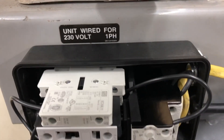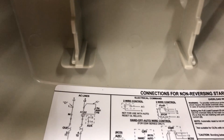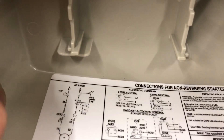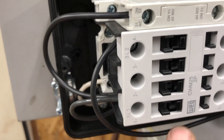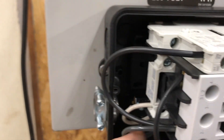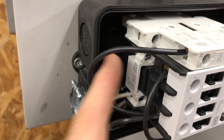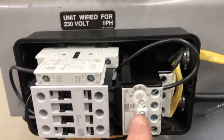According to their instructions, we are doing what's called a two-wire control. For a pressure switch, it says to connect wires to A1 and to terminal 1 — those connect to our external control, which is our pressure switch. So: A1 and 1. Now when this switch comes on, it completes the circuit, the relay closes, and it allows the power that's coming in here to go through to here, which in turn will go to our motor.